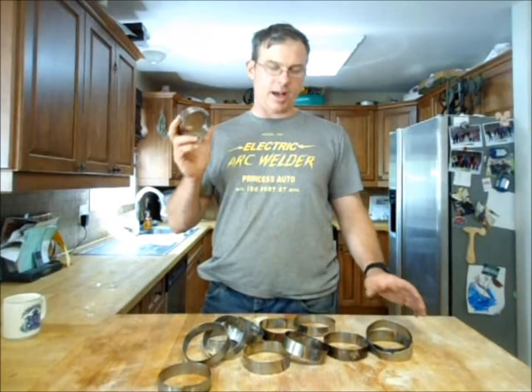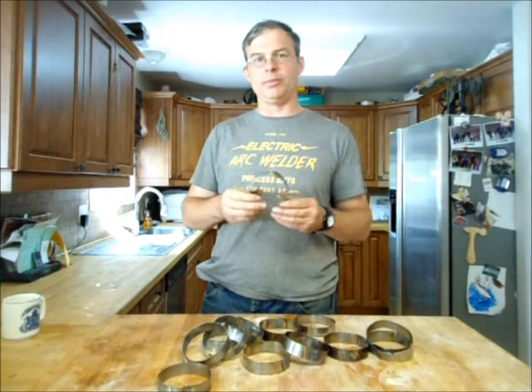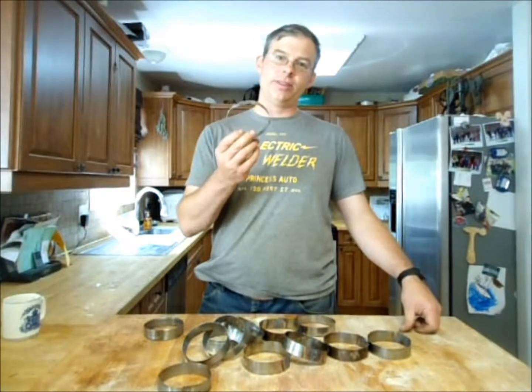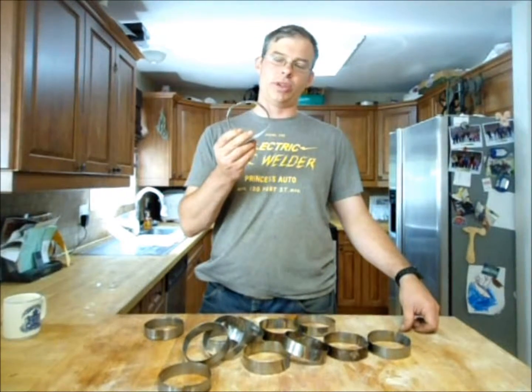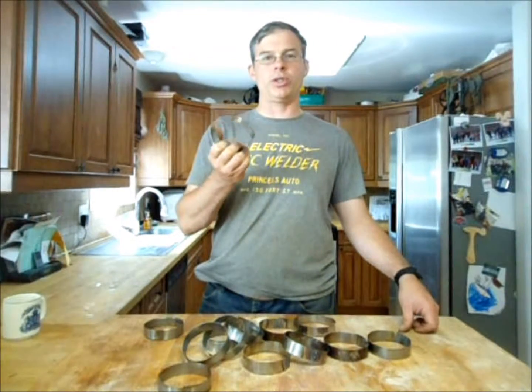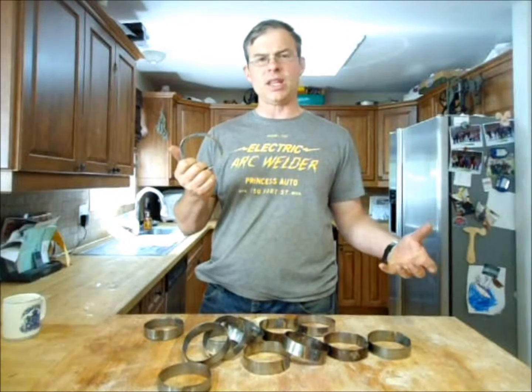These are stainless steel, considerably beefier, and they went together very, very quickly and made from scrap stainless steel. Actually, leftover pieces from the pizza oven that was salvaged from barbecues. Thinner stock you can do with the spot welder. This is 0.02 inches thick. Heavier stuff, oxyacetylene, the spot welder just won't work through it. And this is 0.04, so more typical of what you'd find with the lids.